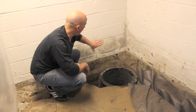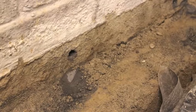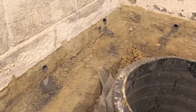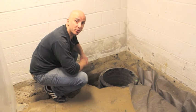Because this wall looks like it possibly is holding water within the cavities of the cinder block, we drilled weep holes within the foundation to empty out the cavities in the cinder block to drain it, so that the water would drain from the cavities into the French drain.